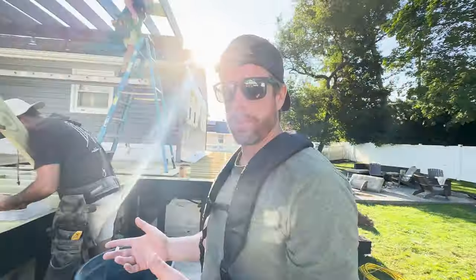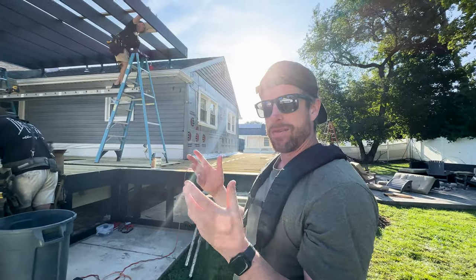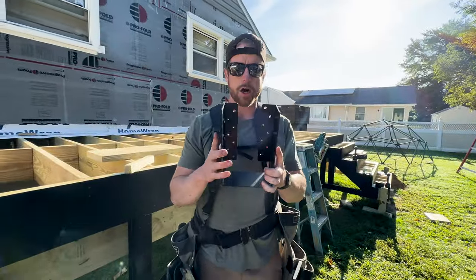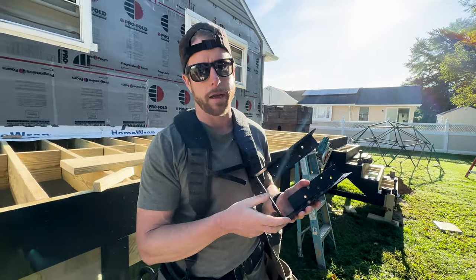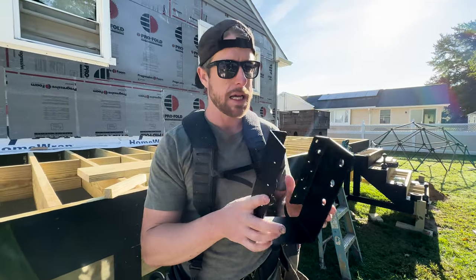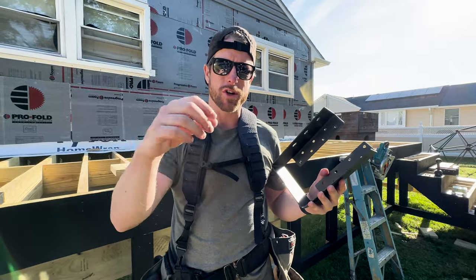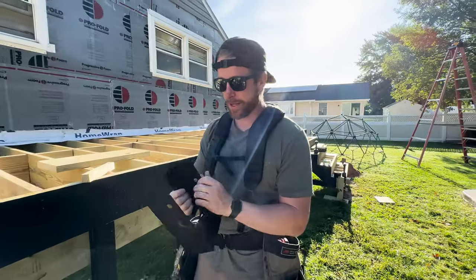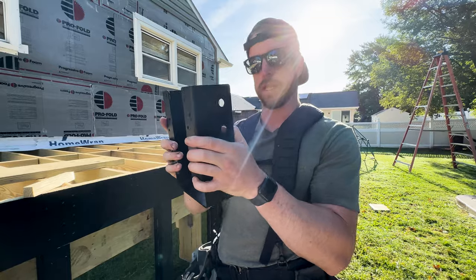What we're gonna do here, we've got a triple 2x12 again for the beams that are coming out over top of our fire pit bar area, kind of like a decorative pergola situation. We're gonna have some string lights there. Let me show you the hardware that we have. Here is our hardware that's gonna hang it. It only comes in dimensions of 1.5, 3.5 or 5.5. Three 2x12s is 4.5 inches wide. So we're going to add half-inch spacers in between the plies, which gives us the 5.5 inch width that we need. It's also gonna help water drain through it so it can dry out. Nice little added bonus. What do you think? We'll be getting this up on the house, and it's gonna go into the header above the window, so we know that we have some nice solid securement there, which is good.